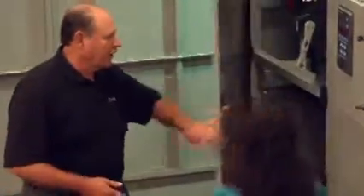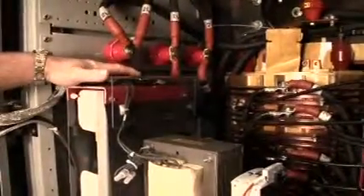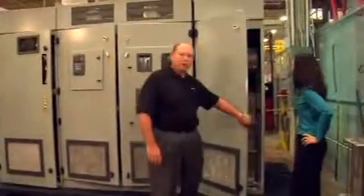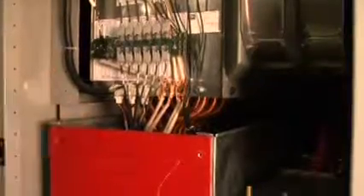For instance, if you look at the front of the drive, we have our ISO switch to put power on the drive through our power fuses, our contactor, our 24-pulse phase shifting and isolating transformer, our patented pre-charged circuit, our rectifier circuit down in the bottom. And one of our major breakthroughs is our single three-phase inverter. With our patented design, we were able to develop a single three-phase inverter, which is about a third the space of what our competitors have to offer. So less really is more, but in this case, it's also better.